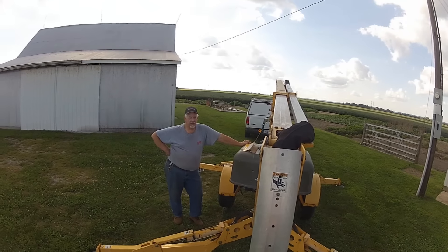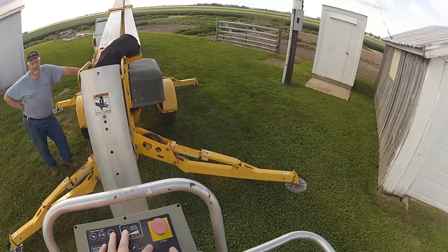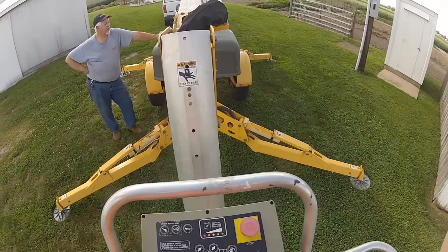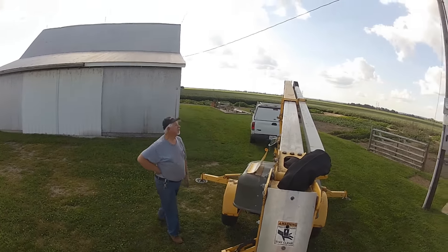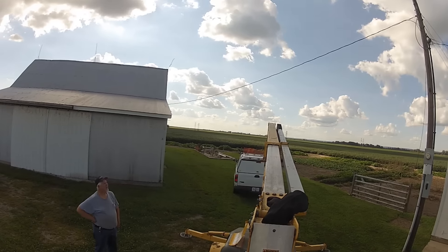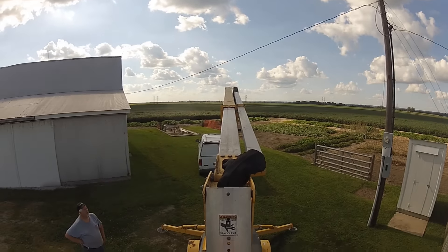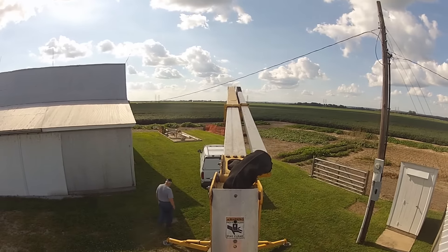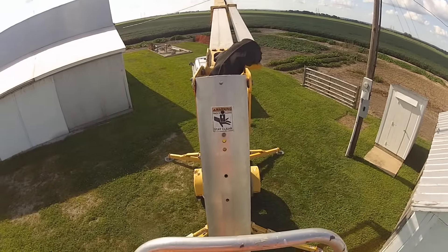Our problem has been an electrical issue in our big shed. We thought we identified the problem up on our main pole outside. The issue is that our lights are flickering and flashing, and at some points some of the lights will dim in the building. We've been testing the outlets with a voltmeter and some outlets are going to 160 volts and some are going to 85 volts — they should be at 110 volts consistently.